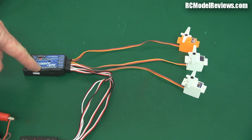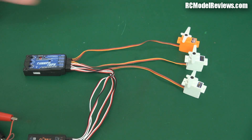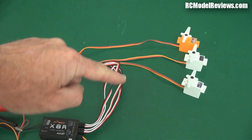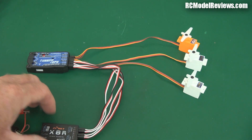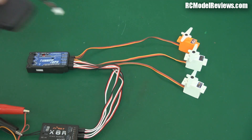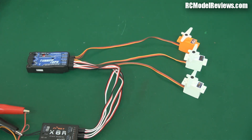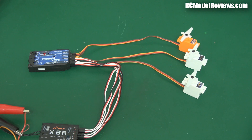Here I've got the T-1000 FC hooked up to a FrSky X8R receiver - they give you the little leads you need to do that. I've got three servos: rudder, elevator, and aileron. The output from the receiver travels through these leads into the flight controller and then out to the servo, so it's a fairly simple installation. I don't have the GPS unit connected at the moment because it will run as a flight stabilizer without the GPS.